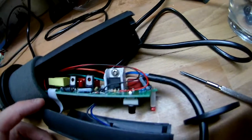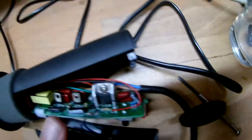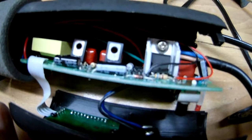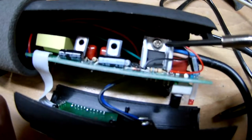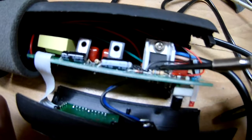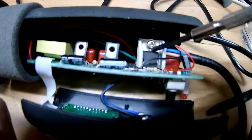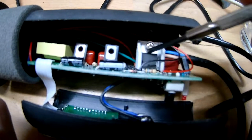I got the thing apart and you can see the two separate circuits. This thing here is an LM317, which was used to drive the motor - it's a variable voltage rail. Not perfect for this purpose, but it works. I thought this would have broken because the motor is out, everything else is out - this is probably it. But I replaced it with a new one, and no, that was not it.